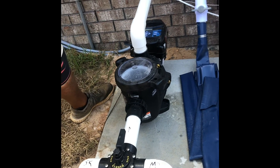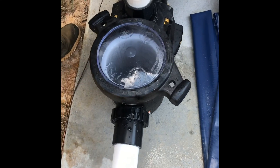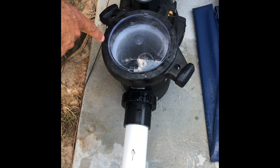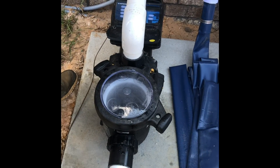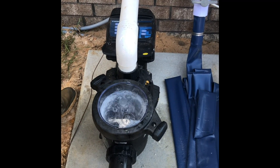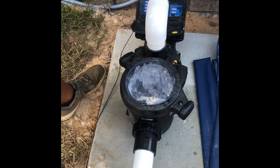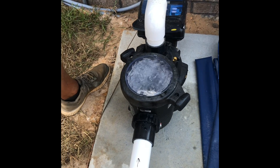We're going to hit resume. 3,500. See, the water's gone out of there. And that's why the priming mode — we want it to ramp up all the way. You can't pull the water in your pipe otherwise. That's all you need; it's not going to burn that pump. It's going to get more and more and more. Let's see if it's going to light off. When I mean light off, you'll have to get a full head — when that water's hitting up here, we call that a full head. When it's max speed, it'll be up there. There she goes.